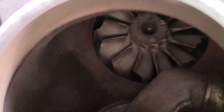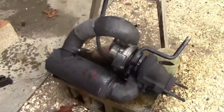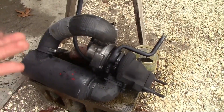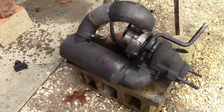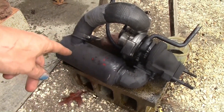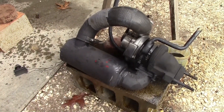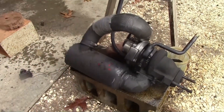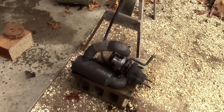It's a bit melted, so yeah, it was a short-lived turbo engine - whatever you want to call it - but it was a good one. I mean, this thing was totally useless anyway, I got it for free, it was already leaking all over the place. The combustion chamber - I think that was a success, except obviously the gas is coming out a bit too hot. So I'm going to have to go ahead and drill some larger holes in the bottom of that flame tube - larger diffuser holes - so a bit more of that cool air can get in there and mix with the gases after the burn, so it'll cool it off better.